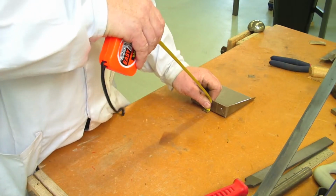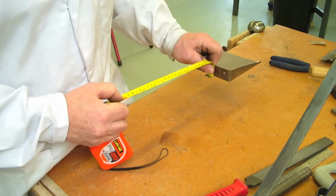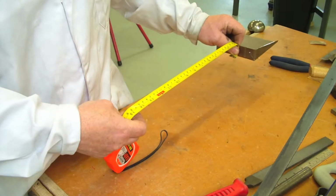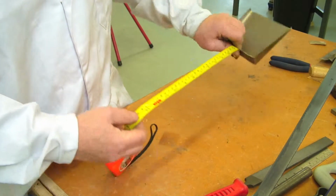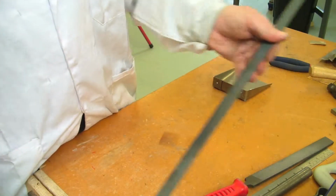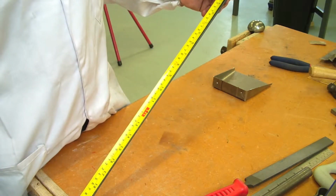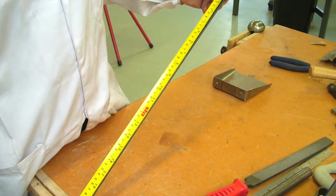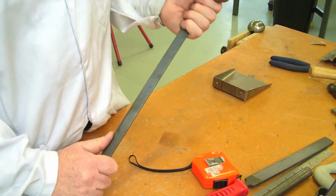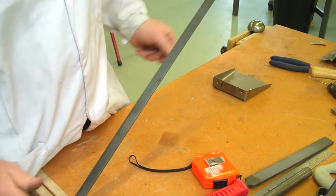If you're going to brush stuff off the floor, fine, keep it up. In this case here, maybe to get ashes out of a stove, we want sort of straight back and a bit of reach to it. So we're going to cut this off at about 400 millimeters, and that allows a wee bit for holding on to the shovel as well. So 400 millimeters, and for that we're going to use a piece of flat 3/4 inch mild steel, and the edges on it are sort of rolled and ergonomically a good piece of metal to use for what we're going to do next.